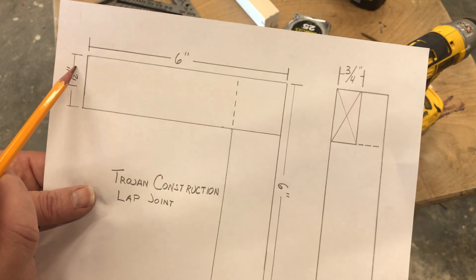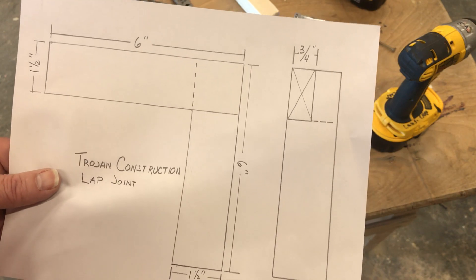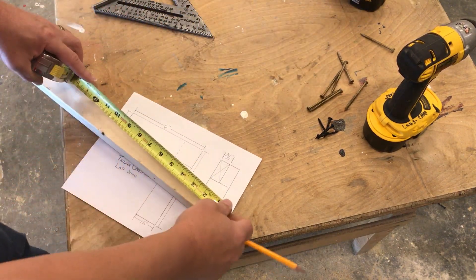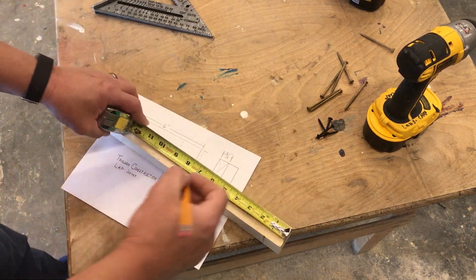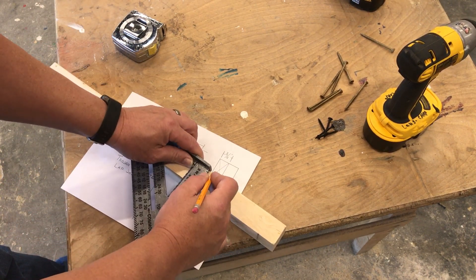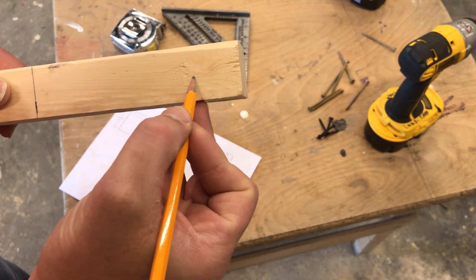For doing this one, we have an inch and a half, inch and a half, inch and a half thick — so this time we're going to use a two-by-two instead of a two-by-four. I'm going to pre-draw some of this on the wood so you can actually see where it's going to go. Again, we're at six inches — we're going to cut those. We're going to take the six-inch block and put a little piece out of it to make a lap.